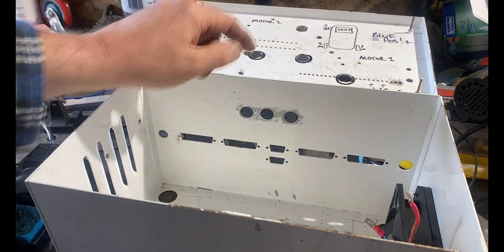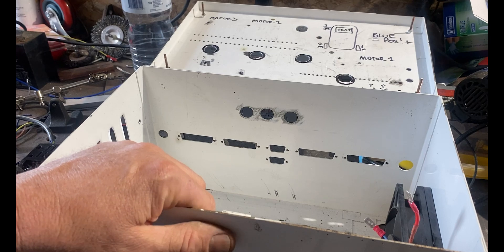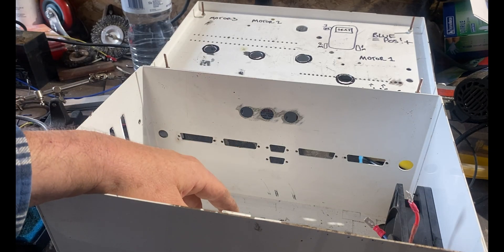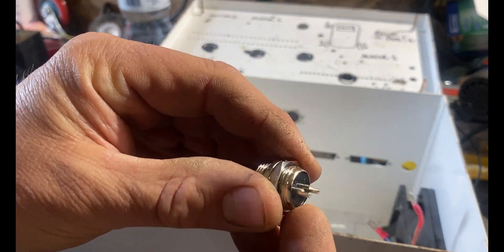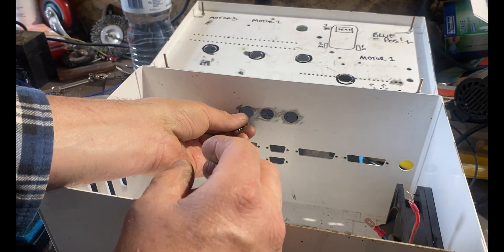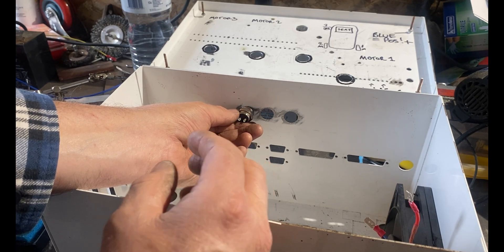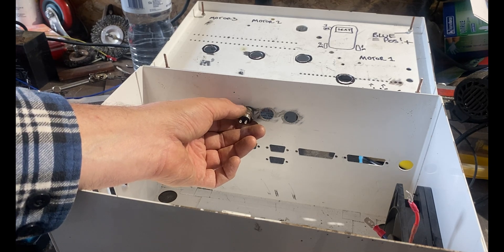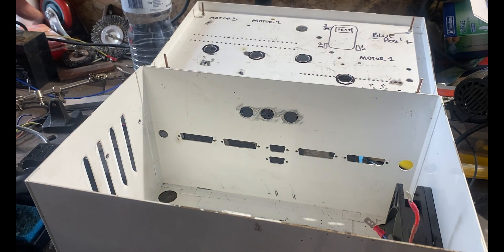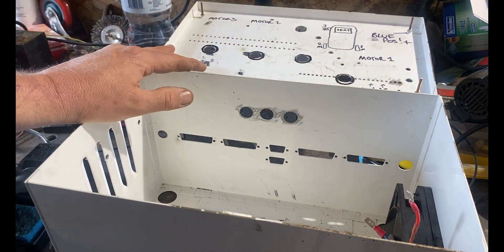The hole locations for our headers — for motor wiring and for the pots — have been marked, so I'm putting those headers in now, before installing all the power supplies, which makes it a bit easier. The main thing to be mindful of is installing them with the solder cups facing up, so the solder and wiring hold in there much more easily rather than trying to do it upside down inside the box. So: 16 millimeter holes with a step drill, then install the headers.